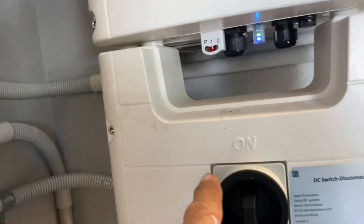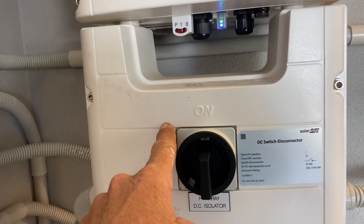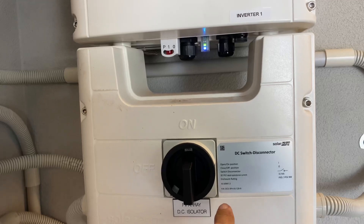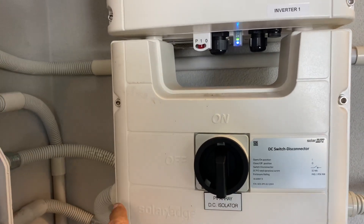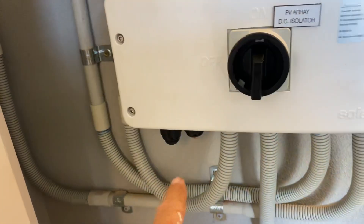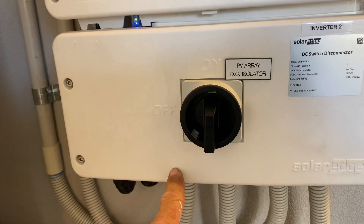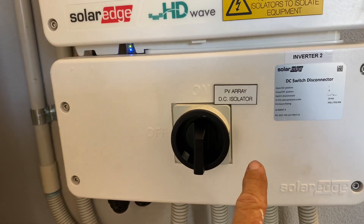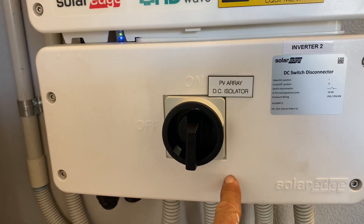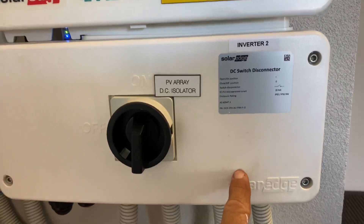You've got your comms cables going back to each inverter — so there's four RS-485 terminals, plus you've got five of your AC, and then two of your DC. Coming down to this one, we've got two from the battery, two from the PV. Two lots of RS-485, so that's eight. Three from the AC.